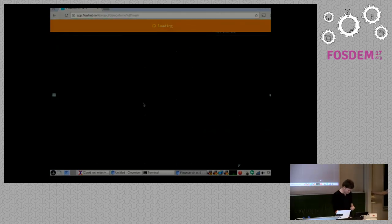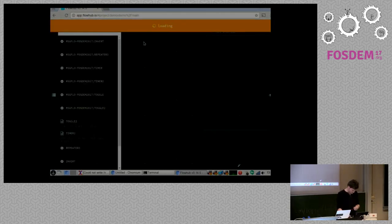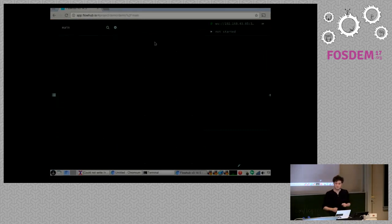We are connected, so that's a good start. About the setup: since I'm doing a demo, there are some IoT devices here — a dev board ESP8266 and a NodeMCU, same chip — just connected to battery and all on Wi-Fi using my phone as a hotspot, which is a nice portable way so you don't have to reconfigure your devices. We're using MQTT to communicate.